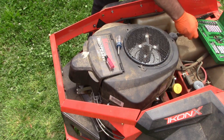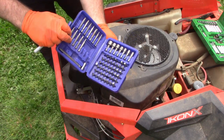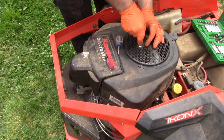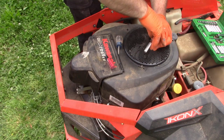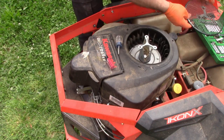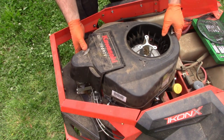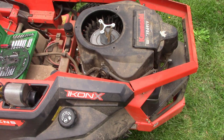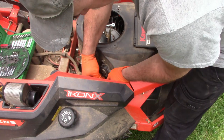I need to figure out what size that Torx star is — if my little set is accurate, it looks like a number 30. I'm going to use a quarter-inch socket to drive those out and remove them. Then there's also this fuel control unit on the side — I'm going to take that off too, just two screws holding it on. I'm doing this to follow the procedures, but removing it makes it a whole lot easier to get that cover off.